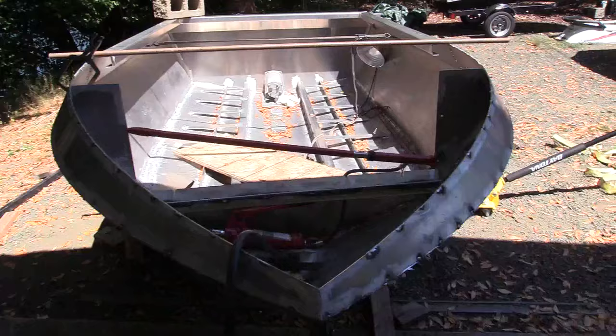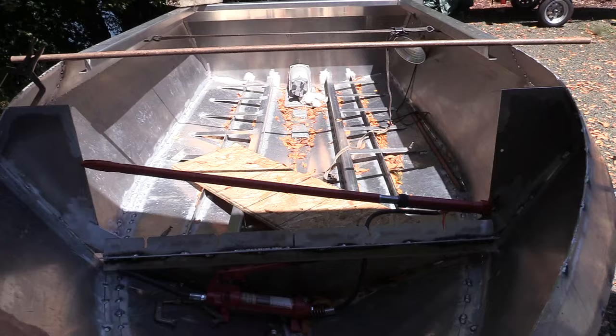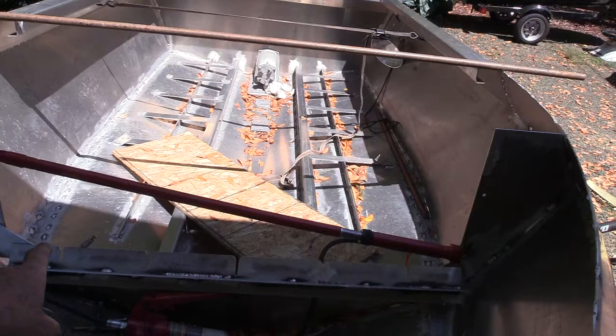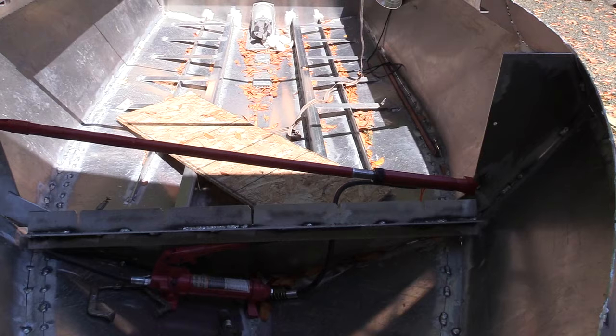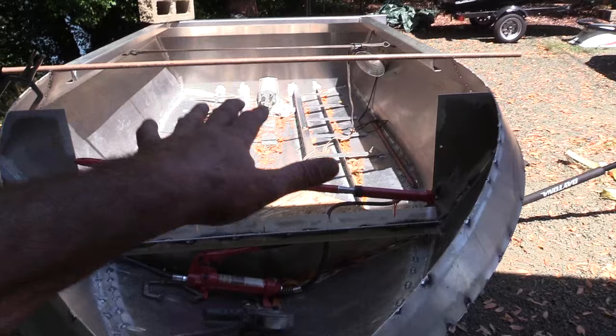Because when the hood sits on here with the normal assembly, you have overlap on both sides and you're pulling it out to fit the hood, putting the whole front end under tension, which gives you support all the way down your panels, up and over and around the whole hood. So that's a normal way of doing it. Obviously, I'm making up for a twisted hole, which means with the hood off, I have to correct if I want the top level and even left to right, side to side.